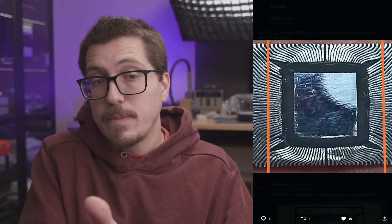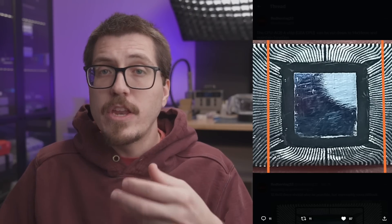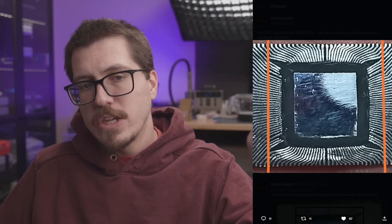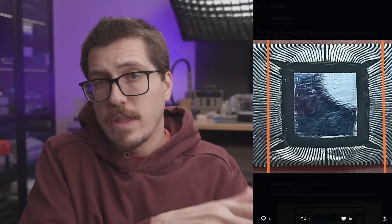You can see a picture here of how small the cut-down CPU is. It's a pretty delicate process because you do have to sand down a NES CPU die and cut it to a specific size. Then you have to solder it onto the Tiny Tendo board, kind of SMD style. The legs of the shaved-down chip get soldered onto a PCB so that you can use it again.